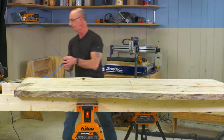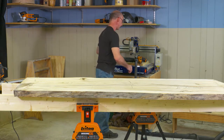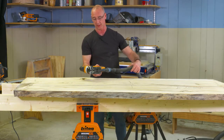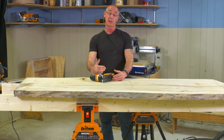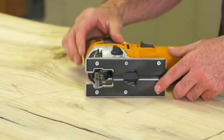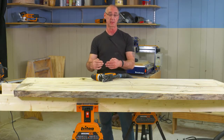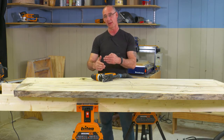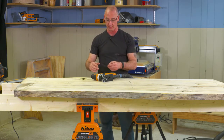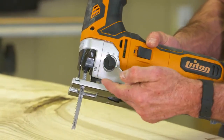We're going to do the work with a jigsaw — more specifically, a Triton jigsaw. Let's talk jigsaws for a second. One of the things we want to have is enough capacity to make our cut, so we've got the right blade in for that. This is a pretty thick slab and I'm going to ask the saw to give me an aggressive cut so I can keep moving. That's all about the pendulum motion of the blade.